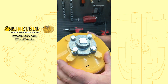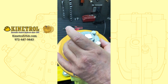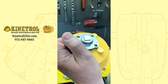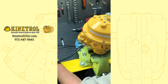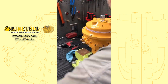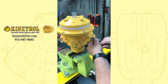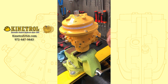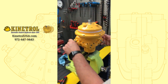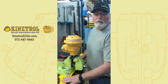Sometimes you can hover right there a little bit — it's nice and loose. Now you're ready to remove your bolts. After you're finished there, you can remove your air. One last thing: we have a drill plug that comes in with the kit, and the drill plug will go on the opposite end of where you put your air. And there you go — you've got your spring installed and you're ready to go. Thank you very much.